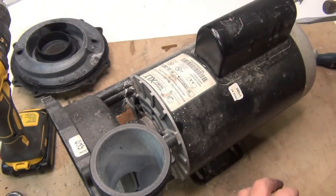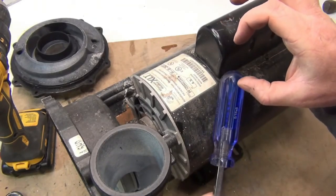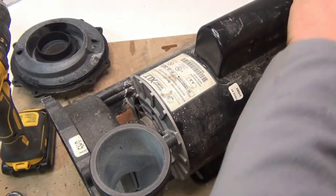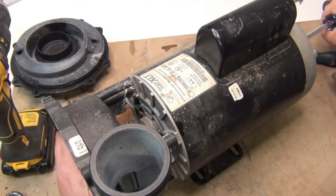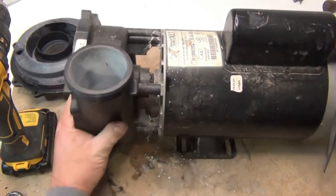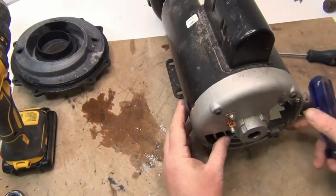Sometimes there's nothing you can get to back there. Sometimes you get a plate that looks like you can pop it off, but they don't come off. So hold the back and try to twist the impeller off counterclockwise. I can't do it that way, so that's your first choice gone.